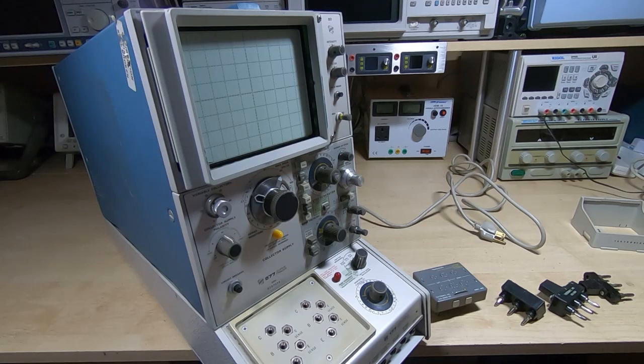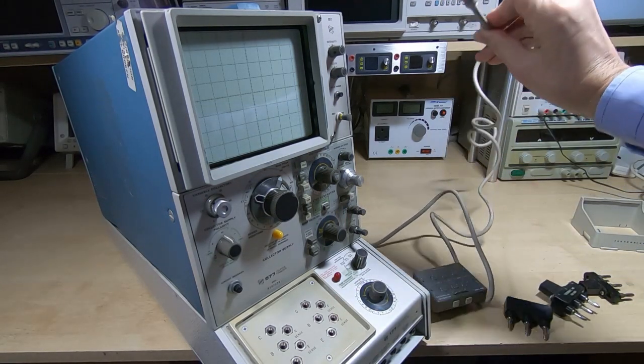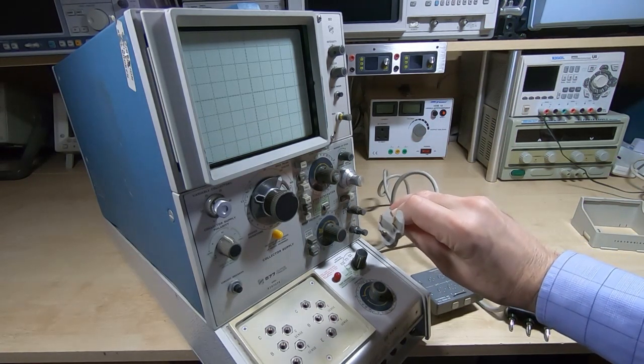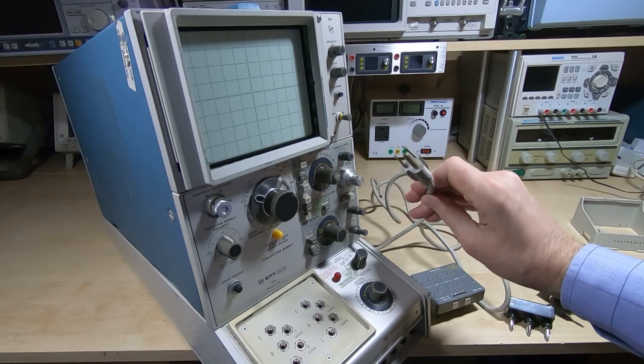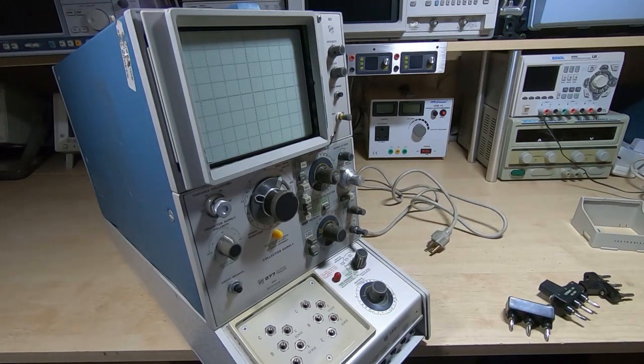Again, the switch is damaged down here, but the first thing I need to do is to open it up, have a look inside. Looking at the mains power cord, it has a US power cord on here, so I'm assuming this is set to 120 volts. So we'll spin it around, have a look inside, and change the jumper settings.